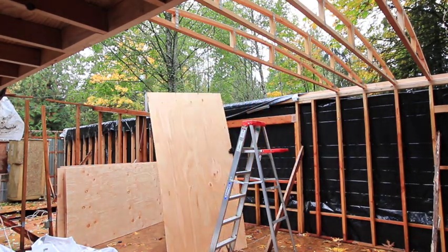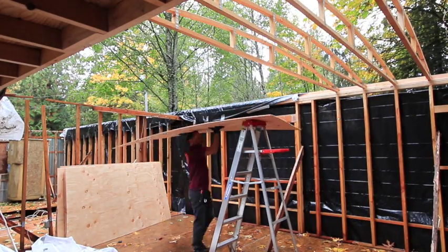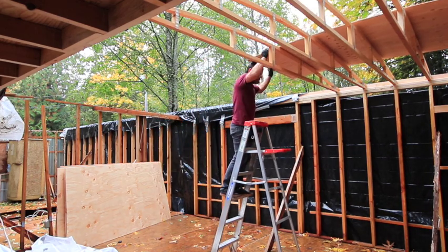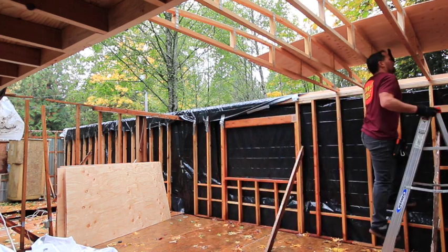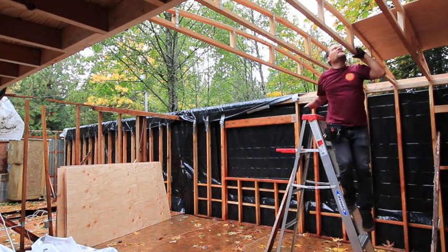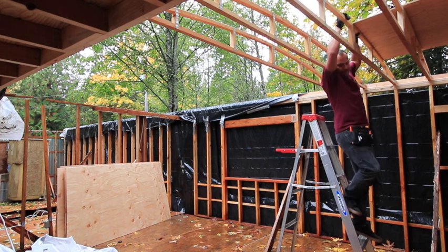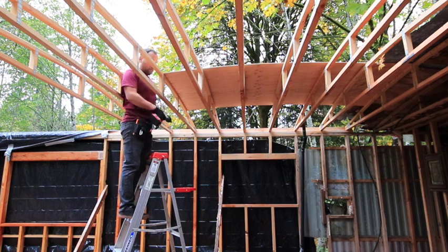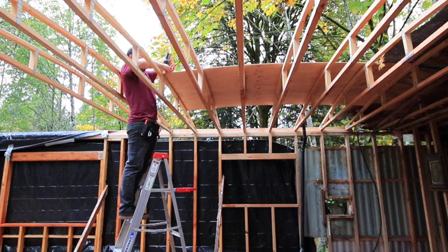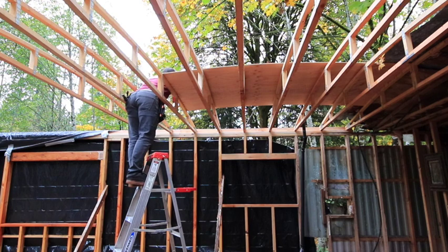I did say I was going to get 1/2 inch, but I decided to go with 3/8. This isn't structural, as in, doesn't need to have too much force as far as weight on top of it, just shear forces. So I think 3/8 is just fine, because on top of this, I'm going to have some foam boards, which actually helps as well to strengthen it laterally, and then just the rubber pond liner on top of that. So it's not like I'm putting roofing tar shingles that weigh a ton or anything like that.